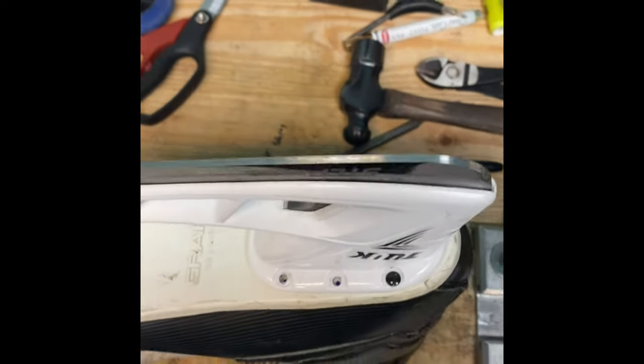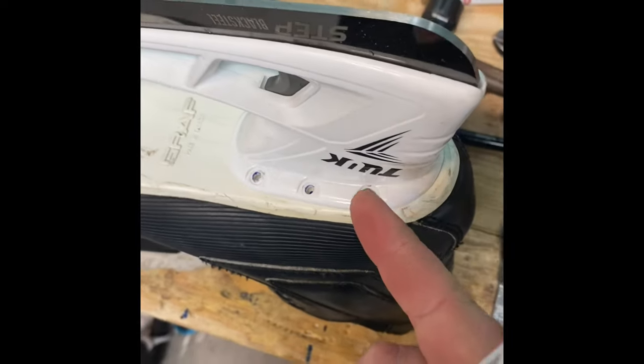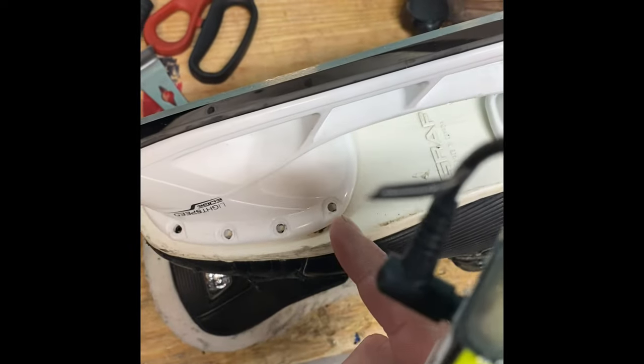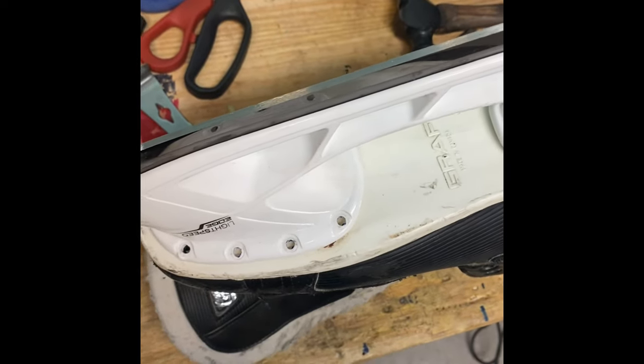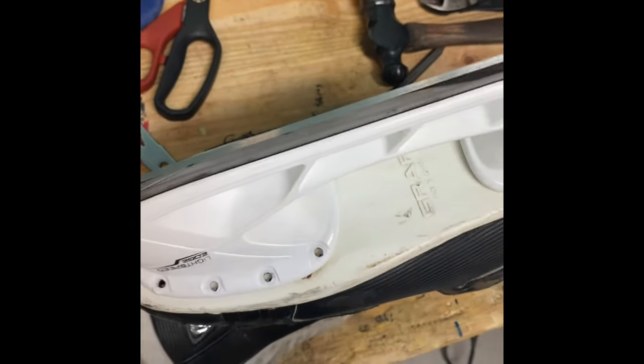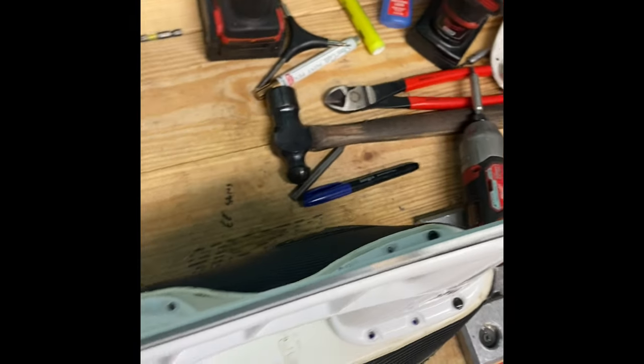and I'm gonna start riveting these bad boys together. And no, I'm not using a steel rivet there. We're gonna use copper. We're gonna do 2 rear coppers, and on this one we're also gonna do 2 front coppers. That way we have really good longevity in this skate and really good torsional rigidity because this player is a little bit on the bigger side.